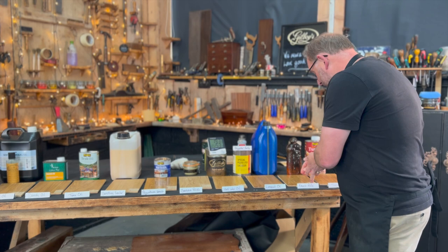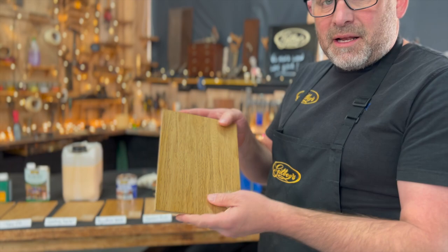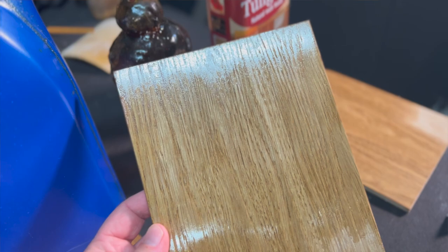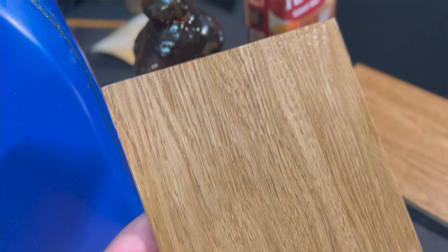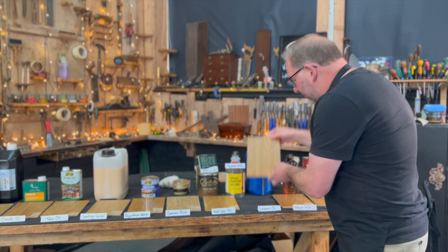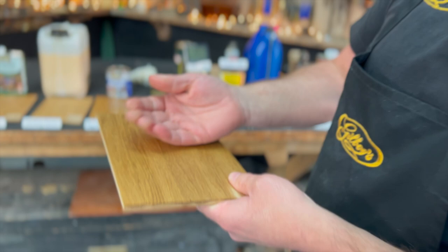French polish — there's a lovely French polished finish. I've just placed a few fads over this, so it's by no means fully rubbed up to a big finish, but you can see it's quite shiny and it's brought out the colour of the oak. I love French polish finishes, I think they're fantastic. Linseed oil — still not dry. I could recoat it but it's still not dry. Even that's boiled linseed as well.